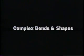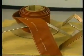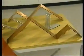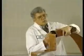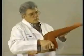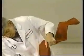Let's start with complex bends and shapes. Many switchgear are manufactured with complex shapes and bends, and because of tight spacing, it can be difficult to insulate or re-insulate your bus. Raychem's BPTM and BBIT tubings are easy to install. To cover a long bus run, slide tubing into place and recover. Recovery is accomplished using a torch; however, OEMs will use ovens in many cases, which is fine for our products.